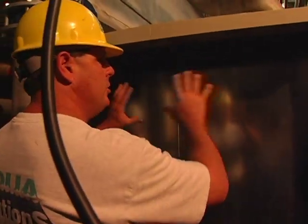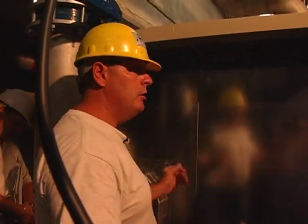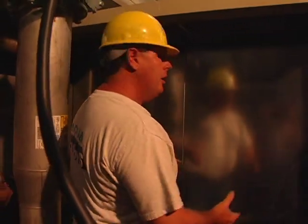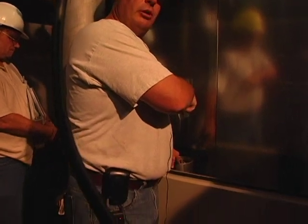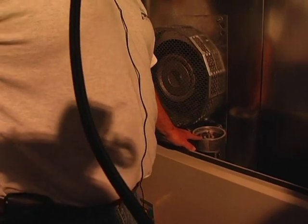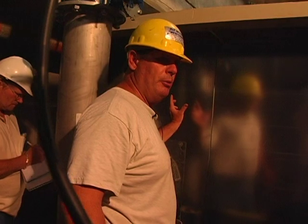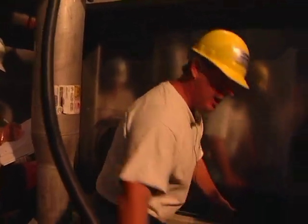This area is not somewhere you'll have to maintain very often, so the likelihood of taking that panel off is fairly slim. But you can see it does come off, and what we have in front of us is an air cavity — an area for the pressure relief valve to relieve. That's your pressure relief valve. Pressure exceeds a certain pressure — probably close to 15 PSI — and it's going to relieve the pressure building up in your blower, leaving this cavity and venting out.